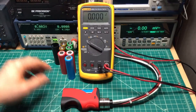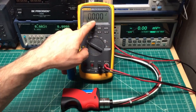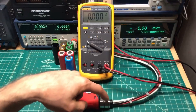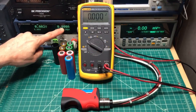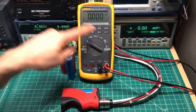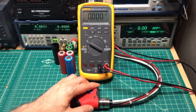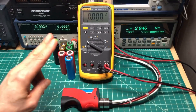At 0.2 ohms, this is showing voltage drop for one half of the wire — it has to be doubled for the other half. This shows the battery voltage at the atomizer, this shows the power, this is the resistance, this is the current flowing, and this shows the voltage reading at this end. At 0.2 ohms for the Samsung 30T we got about 18 amps, about 65 watts.